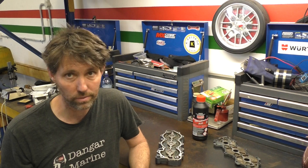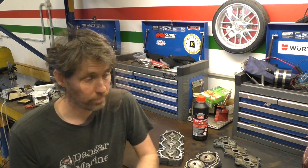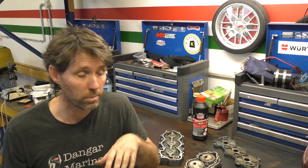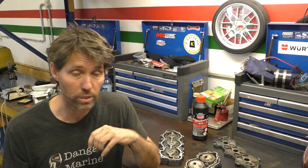Take it with a grain of salt, if you'll excuse the pun. This was obviously just a follow-up to last week to answer questions on what you can do about this sort of corrosion, and I certainly didn't know the answer so I was keen to do a bit of experimenting. The end result: if you're looking to flush an outboard after every trip, use either fresh water or put a bit of Salt Away in it. If you're looking to restore an outboard that has really corroded up over time, I'd recommend the acid — but just be careful: gloves, glasses, good ventilation, because even at 20 to 1 it can still burn skin and you can get fumes. Take care and I'll catch you next week.